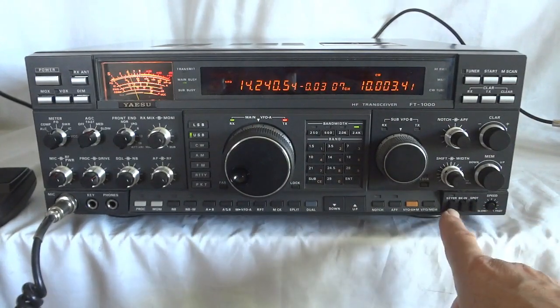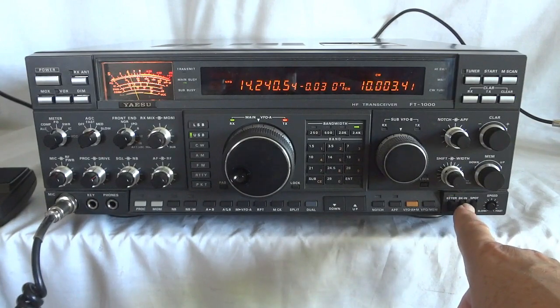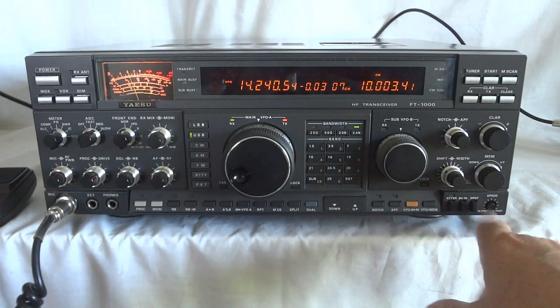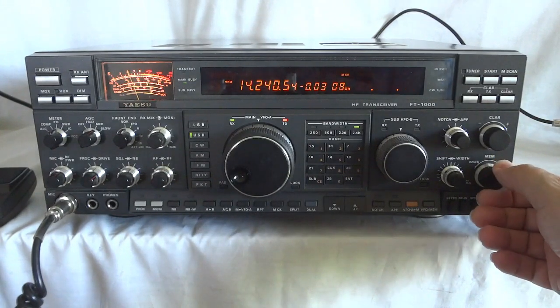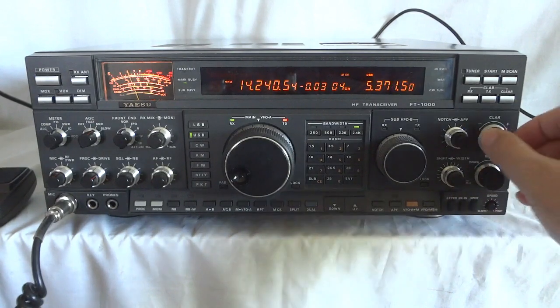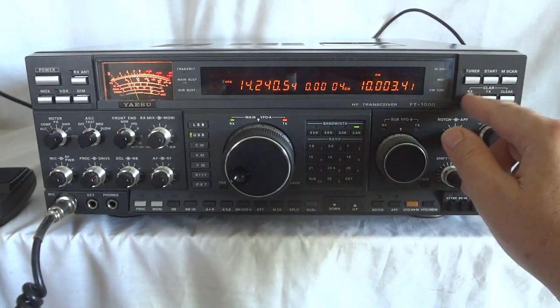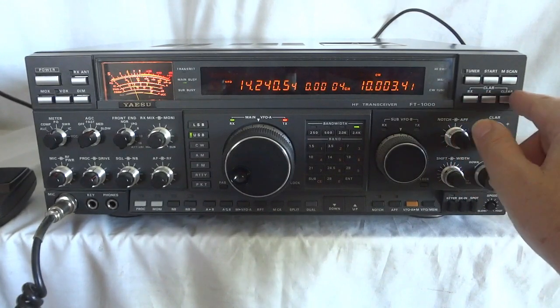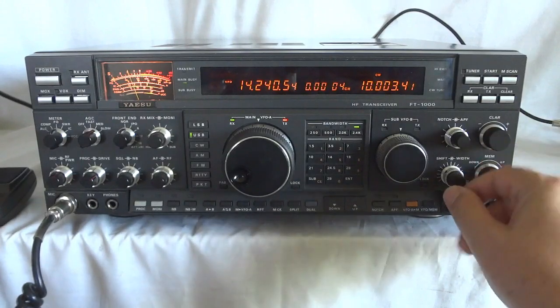All right, what else do we have? We got the keyer, if you're into CW, break in, you can set it for fast break in. Spot, I already showed you, that is to check whether you're on frequency with the other CW station. We got the memories, showed you that already in effect. We got a clarifier. You can do that for transmit, for receive, transmit, or both, or clear it again. APF and notch I showed you, and this is interesting.